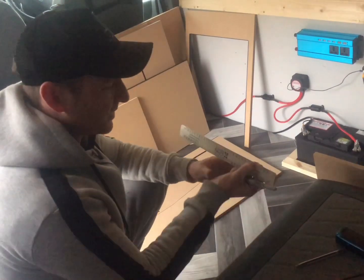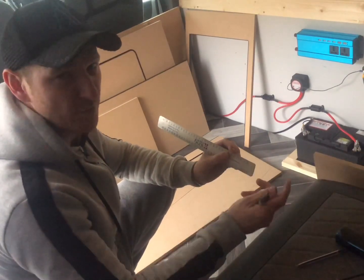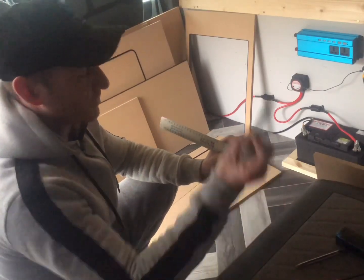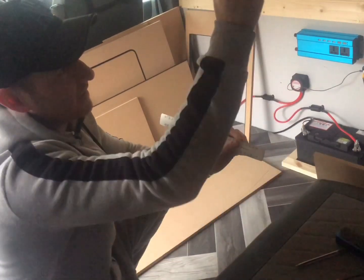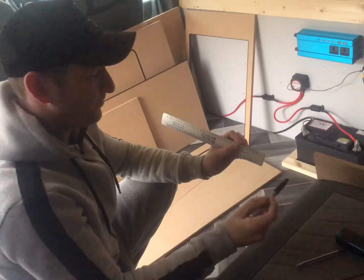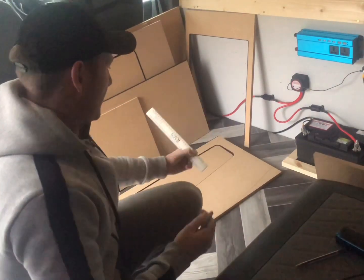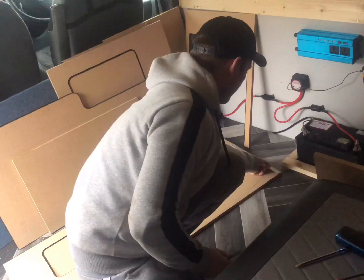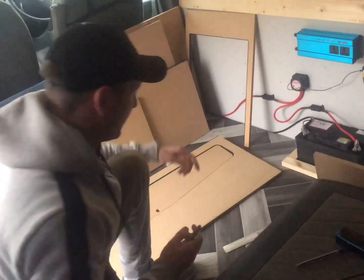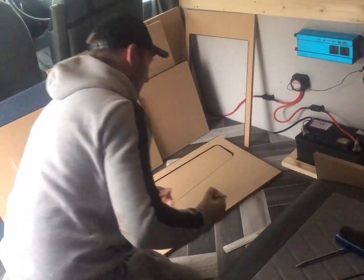There are a few ways you can do it. You can mark it fixed to a compass — a compass like you'd get in school with the pencil at the end — and just keep that gap from the top and then make the mark all the way down and you'll get yourself a curve. But I don't have a compass. The way I've done it is I got the measurement from the top, just made a dot, and progressed it all the way down. That gave me that line, and I'm going to mark it with a sharpie so we can see it a bit better.